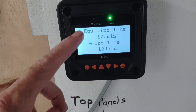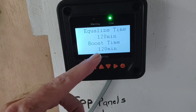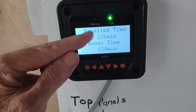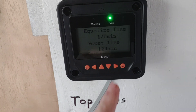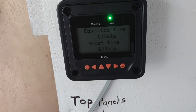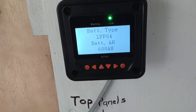This is the only part of the preset you can manipulate if you want to: you can change your boost time and the equalize time. I'd make them match since they're set at the same 14.5, that way it will never actually try to equalize. Currently on my other EPEver I went from 5 minutes to 10 minutes to 30 minutes and I really like that. I'm going to leave it exactly on the presets for now — that is a game changer in my mind.